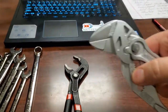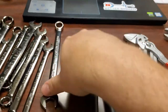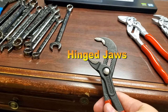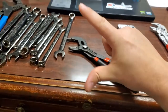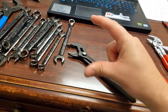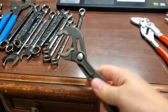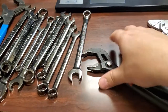It's got a cam and linear jaws. The jaws here are linear — see how they go straight up and down? The jaws on traditional adjustable wrenches are not linear. If you don't get the right bite angle, you are actually at a V, so it wants to eject the fastener. That's why you have to get the handles as close together as possible for the size of the fastener, or else it will want to eject the fastener.